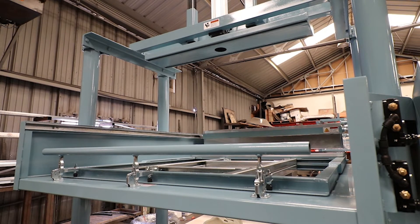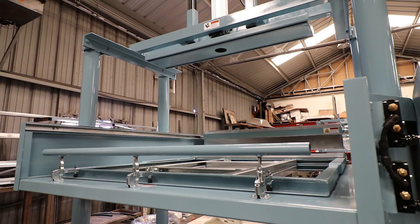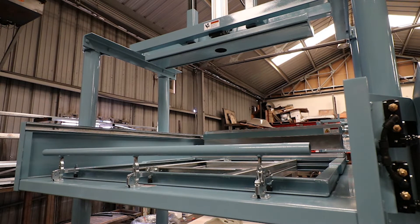Shown here is the upper tooling table for auxiliary tooling. With the upper tooling table you can use mechanical pinches, you can use plungers, you can do inverted tooling where you put your vacuum forming tool upside down to take advantage of the plastic sag, in addition to various other applications.